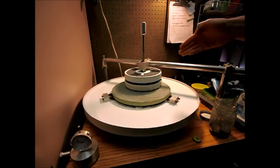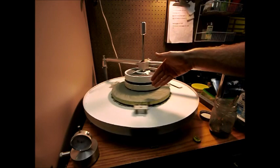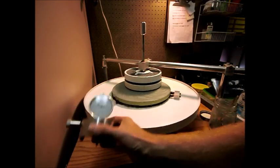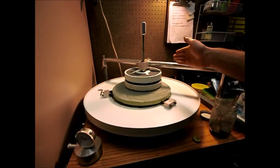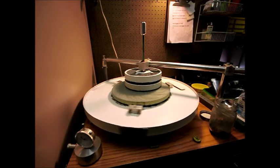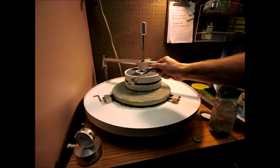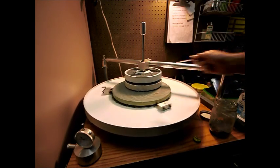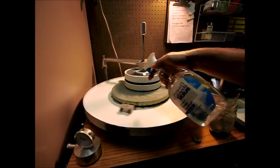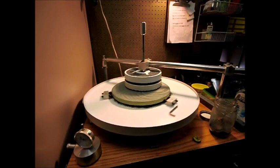I have my tool in the same area as rough grinding. I'm at the sphere right now. I can't tell any difference on the spherometer across the entire face of the mirror. I'm at about 320 grit, adding it every once in a while. It's really easy and low maintenance at this point — I'm adding grit and water every about five minutes.